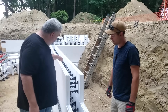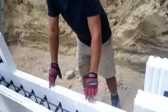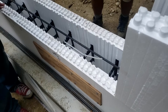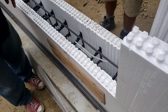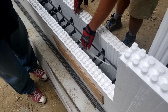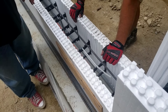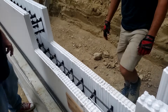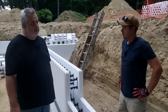I noticed we have the metal clips but also a zip tie here — why the switch? This right here is the common seam we discussed earlier, connected by the plywood. We work from the corners to one area, placing one brace here and another staggered. This gap is too big for the vertical clip, so we use zip ties to tie them together and give that extra reinforcement and stabilization. It's a pretty neat system — once you get concrete in there, this is going nowhere.